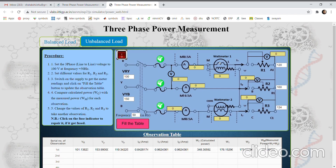There is an unbalance in the voltage as well. The total power consumed in the three-phase circuit is the sum of the readings of these two wattmeters. We can also verify it by calculating the power manually using the voltmeter and ammeter readings — the calculated power can be estimated using V_R·I_R + V_Y·I_Y + V_B·I_B. Let us again vary the value of resistances and see one more reading.